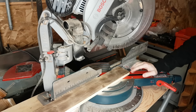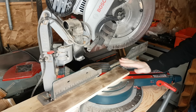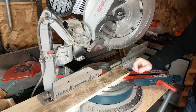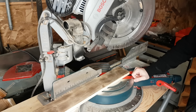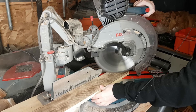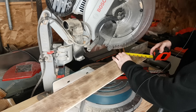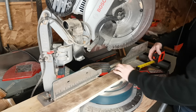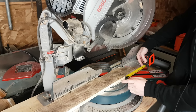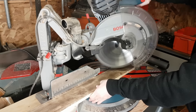So I've got my saw set up here. The first cut you're going to make is right at the end of the board at 54 degrees. Now if your saw does not go to 54 degrees, I don't think there's a way to make this without one of these bigger saws that goes beyond 45. If you still want to make stars with a saw that only goes to 45, check out my channel — I've got plenty of five-point stars. So we'll make that first cut at 54 degrees. Once you get that first cut done, you're going to measure this angle — it's six inches long. I'm actually going to mark it at six and a quarter, and cut three pieces that are six and a quarter long while keeping the angle the same. I'll set up a stop block to do that.